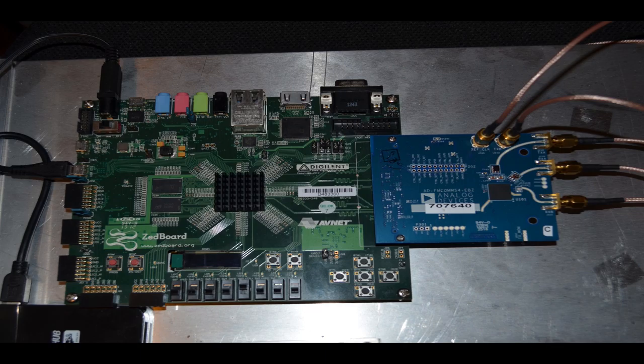Because they both use libiio, the interface is exactly the same, so software that works on Pluto will also work on this particular platform. The only caveat at the moment is that there is no x8 interpolator in the FPGA fabric of the distribution that comes for the Z board from Analog Devices, which means that it won't operate reduced bandwidth television. But having a higher bandwidth means that it should be able to work better on the higher bit rates, 8 megahertz DVB-T, etc.